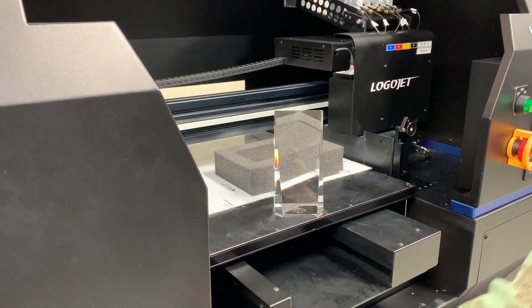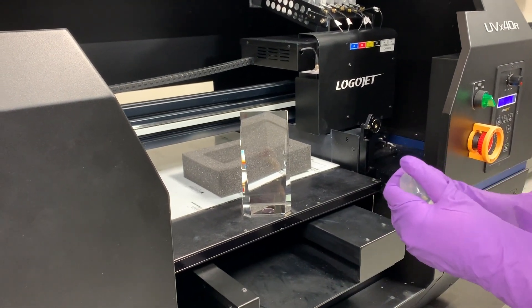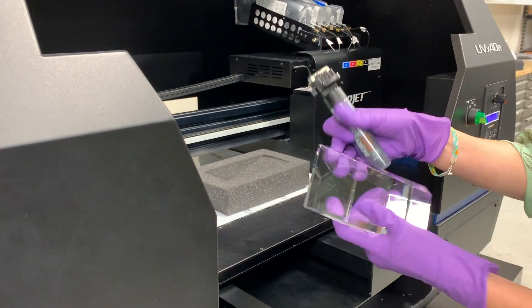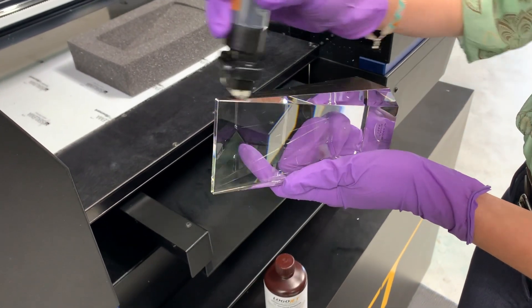What we're going to do today is prep the surface with an acrylic water-based paint on the side of the glass. This is very quick to apply as opposed to using tape, and is also very simple to wash off with a cloth.